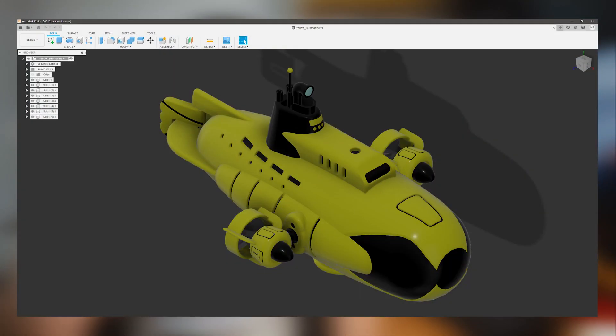A short disclaimer — this video is not going to be about building a submarine from scratch. What we're going to do is find a nice model that suits our needs and adapt it around our Nixie clock. Because we'll have to print all this with an affordable 3D printer, the task will prove itself even more challenging. First, we have to find the right model. After spending many hours on my usual websites, I managed to find this. It should suit our needs to a certain extent, and if it doesn't, I'm cool with getting dirty with it — by that I mean tweaking some of the geometries or even scaling some of the features. Before starting to alter the model, it is imperative we check it against the 3D model we've generated earlier.